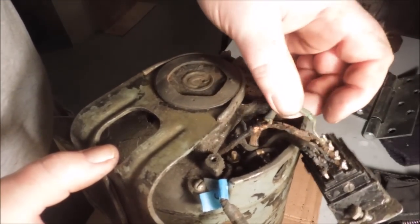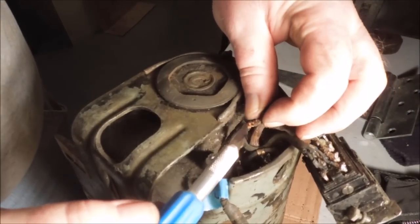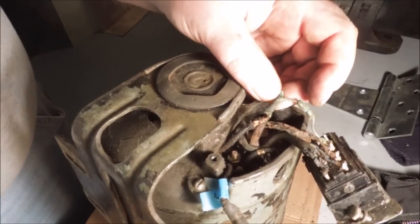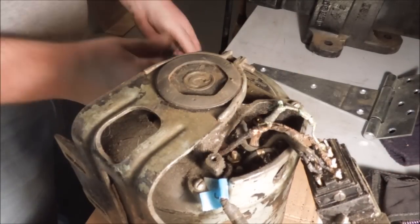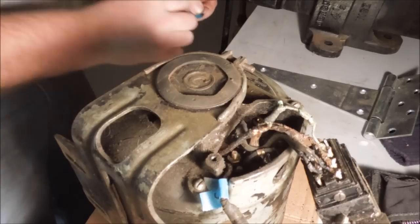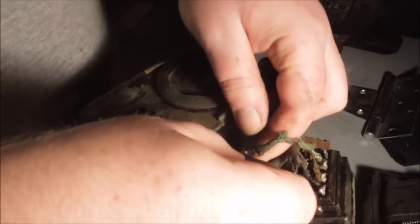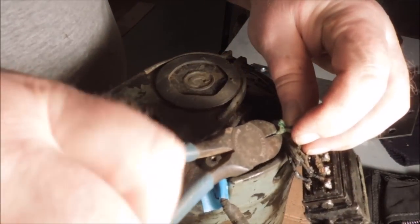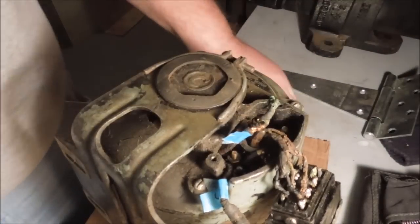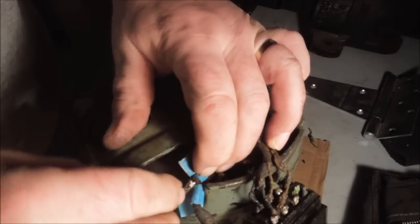You can tell the difference in the size of the wire. That's the lamp cord that they wired to this nice thick number 14 wire in there. And therefore, it really has no ability to handle the amperage. This is wire number 3, and this is wire number 4. Tuck those over here out of the way. So then get in here and work on the next two.